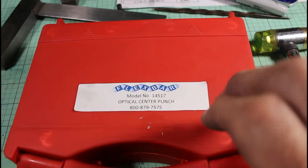I think I'm going to mill out this side a little bit so I have lots of room for tightening the belt. I'm pretty sure I'm going to be up in this range, but what the heck, let's go a little bit further that way too. Yeah, I think that's going to work. So just to be clear, I've got a 1/4 by 20 bolt here and that will drop in and clears pretty nicely because I used a 1/4 inch milling cutter and there was some vibration that moved that slot just a little bit wider. So I think this is going to be just fine.